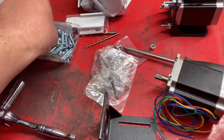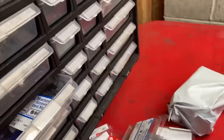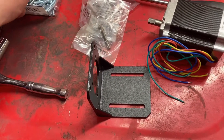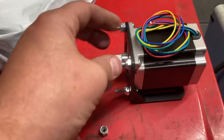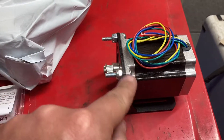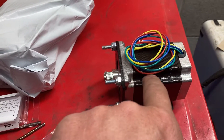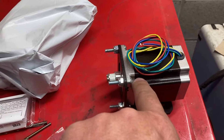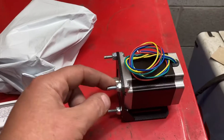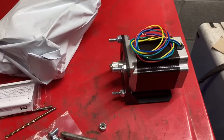I'm going to order some other hardware — I'm just going with what I have here. I don't feel like running out to the hardware store just to get through something. I'm throwing some 10-24s through them with lock nuts on the front. You can't put the nuts on the back — there's not enough clearance in the recesses by the stepper motor. Some 10-24 Phillips through this way with the lock nuts, and then I'll zip off the excess stud.